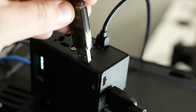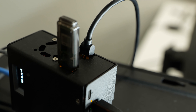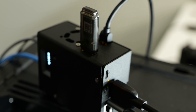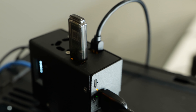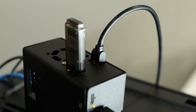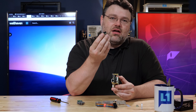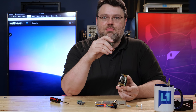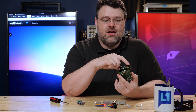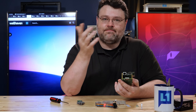You can chain this to a non-IP KVM and effectively have an IP KVM. You don't need the Atmel HID board with Level One KVMs — it works fine with the USB on-the-go interface. The USB Type-A on the side lets you plug in a 256 GB flash drive with ISOs or operating system installation images. The PyKVM can emulate a CD-ROM for your host device, so if you've got a Windows ISO, it will pretend to be the CD-ROM and you can boot off it and install Windows completely remotely. Most people don't strictly need this accessory, but it does work dramatically better if you have it.